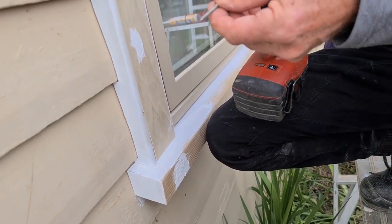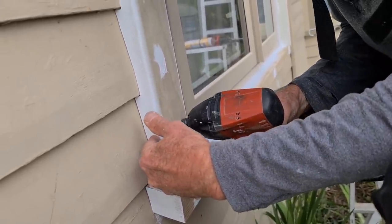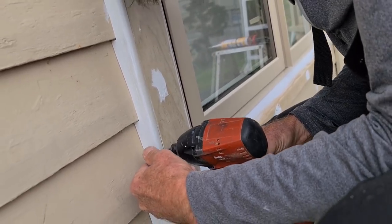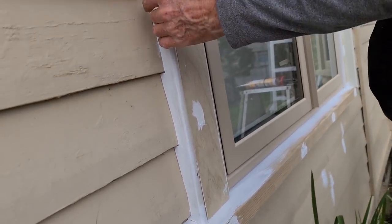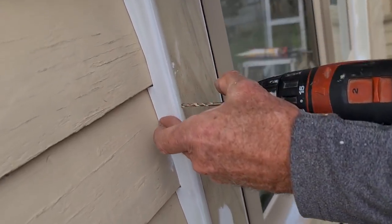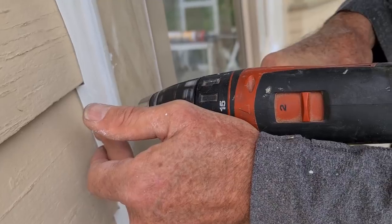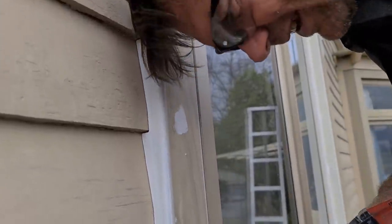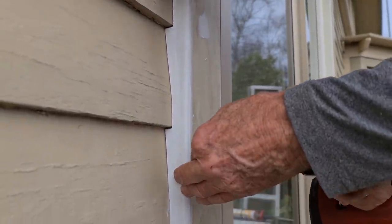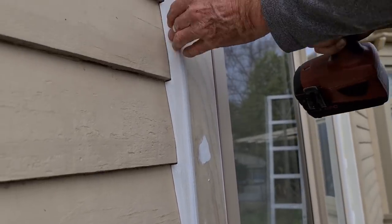Special weatherboard screws for this. Right. Glued and screwed, eh? Yeah. Right. Fill in the heads, obviously. Yep. The idea is it stops the rain from coming through. Yeah, a bit of work involved there, bud. Yeah, there is. How do you actually cut even on those? By hand. Really a lot of work.